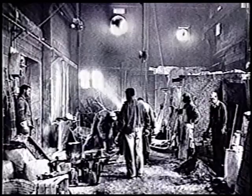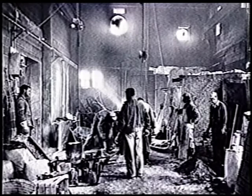After the retouching on wax, and I told you it had the core inside of it, of a certain kind of plaster, they now coat the wax, which has what they call gates and vents attached to it. They seal it in a large, what they call the investment mold. The investment mold is a great, huge thing, you can see it in the back there. They put this investment mold in an oven, right side up with a hole in the bottom. They heat the mold and the wax melts out.